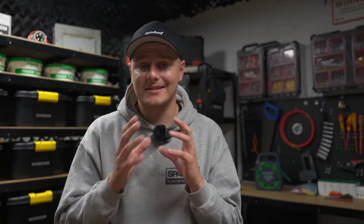The first part of the glanding process is getting the shroud on. The reason you want to get this on first is because if you forget it, it's going to be an absolute nightmare — you're going to have to take the whole thing apart, take the steels back down, just to slide it on. You will do it, but you don't want to get in the habit of it.